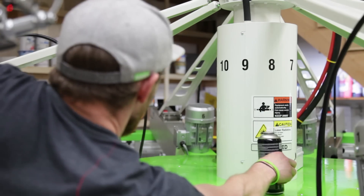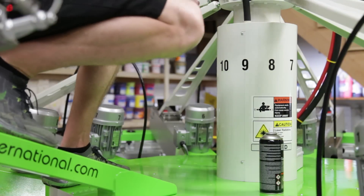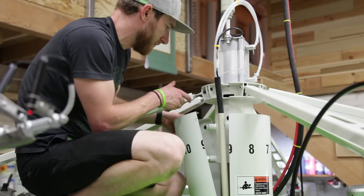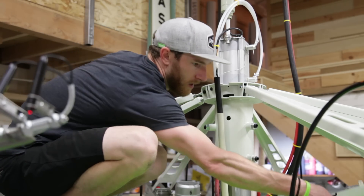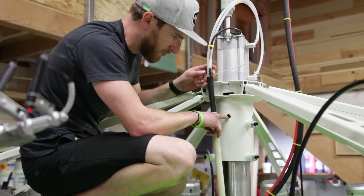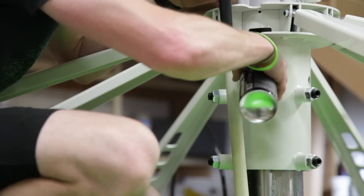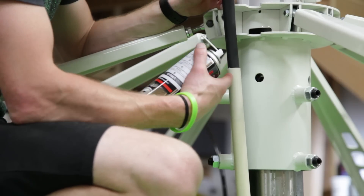Now on to the next maintenance item: the lifting cylinder. Go ahead and push in the security bar, and with a 2.5mm Allen key climb up on top of the press and remove the four screws holding the center shaft cover. Separate the cover and set it aside so you can access all the holes in the center shaft. Spray lube in the direction of the nylon — spraying inside each hole all the way around — and repeat as necessary depending on how many holes you have in your tower. Next, reinstall the center shaft cover.